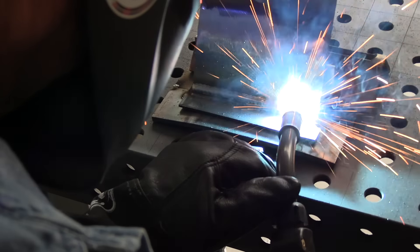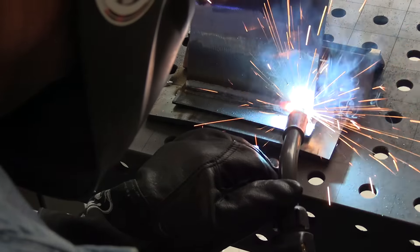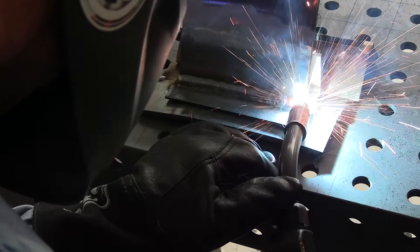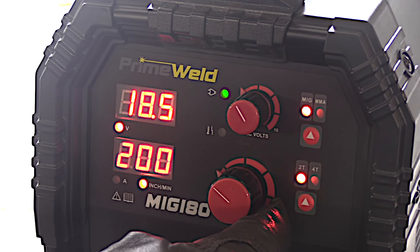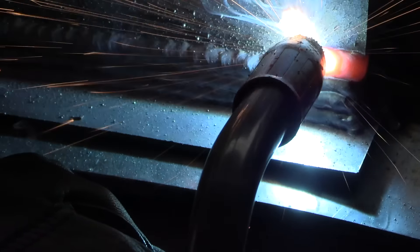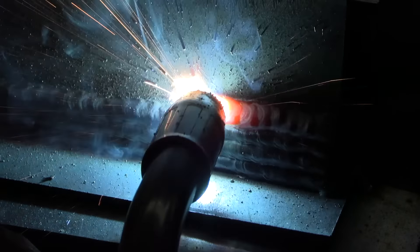It's a very inexpensive way to get a whole lot of practice. I don't think there's any better practice than this when you're learning. When you are learning, sometimes it helps to lower the wire feed speed just a little bit — it kind of slows everything down. I'm going to drop it down to 200 here. Because there's no fillet weld or groove weld, there's no place for the metal to bite, so it makes sense to turn the wire feed speed down a little bit when we're just welding a bead on a plate.